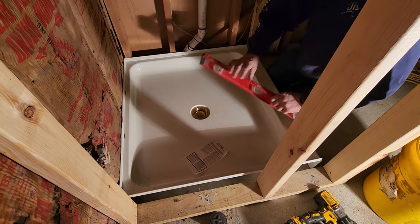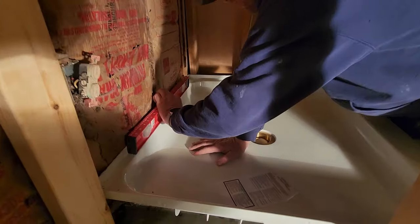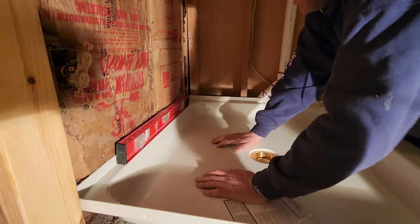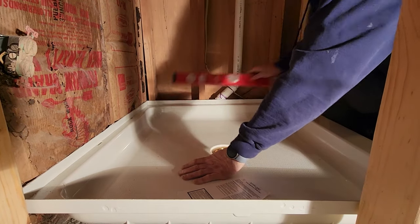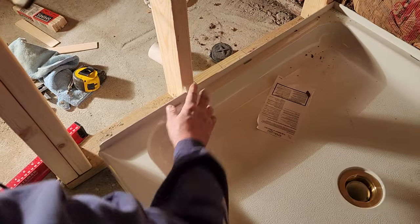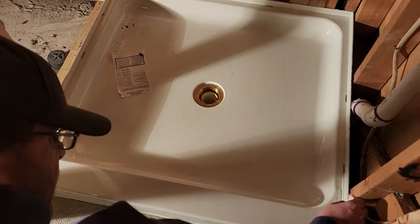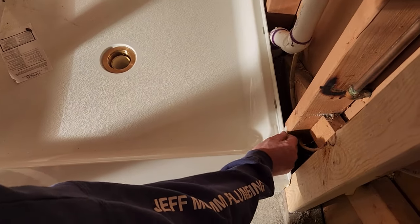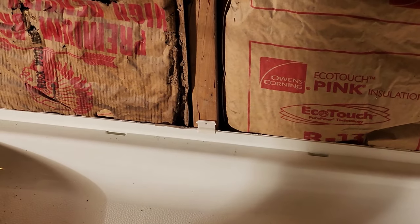You can see how that piece of pipe is stubbed up just perfectly. He's going around the base, pushing the mortar mix in underneath. Now he's going to take his level and go all the way around — you want it perfect. When you install the shower walls later, they're six feet tall; if the base is even a little off level at the bottom, it's going to put your shower walls really off level at the top. The base comes with little clips that you mount on the edge to fasten it to the wall.